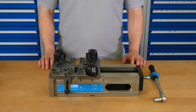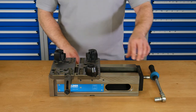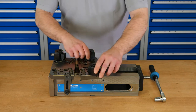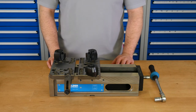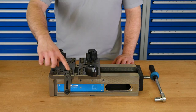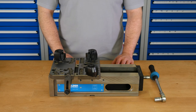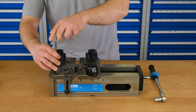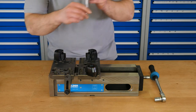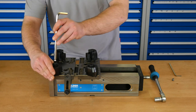When we use the grip clamping we have to mount the support jaws on the base body. The jaw on the back is fixed again and the jaw on the front is movable and also oscillating. It is oscillating because when we have a workpiece with an uneven shape, the jaw adjusts to the position of the workpiece. As you can see, the support jaws have many and also different mounting holes. This enables us to mount different gripper studs flexibly on these jaws. You just have to remove the screw block and then mount the suitable gripper stud.